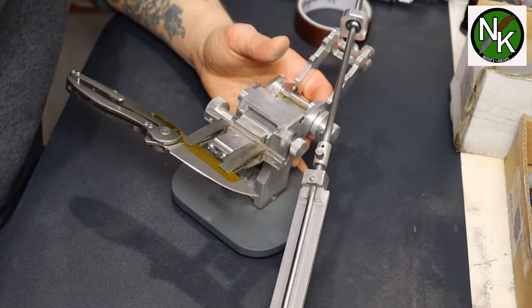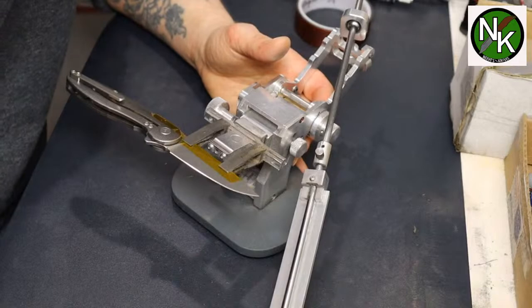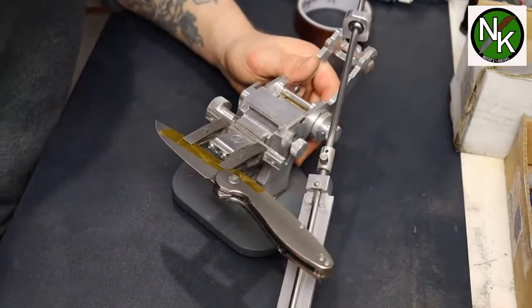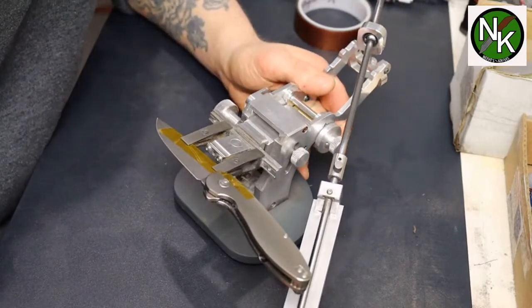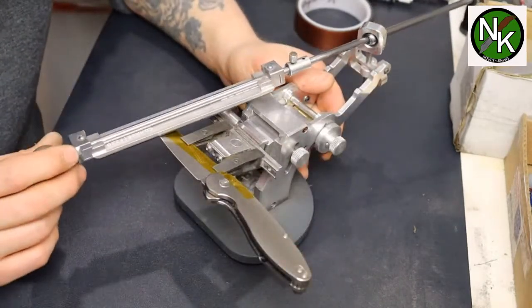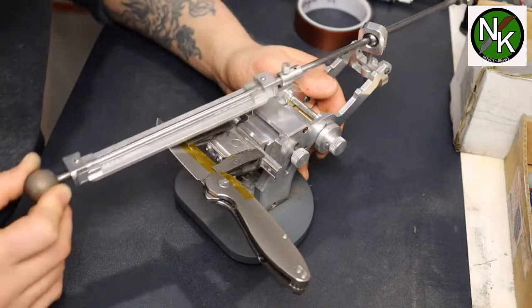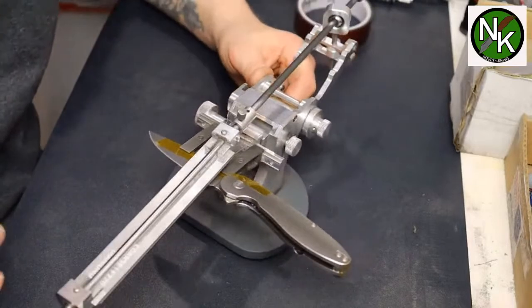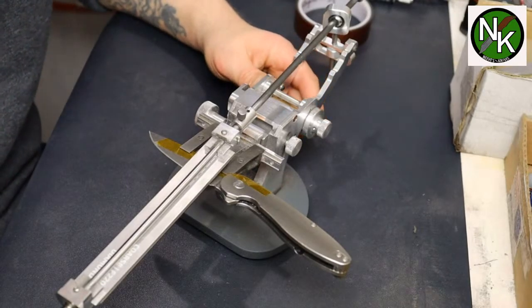However, the problem with it is that you are less likely to hold your angle accurate. You're more likely to do damage, more likely to do weird things. So it's not good. Like tip damage, like not holding your angle accurately, like lowering your angle, just doing things that are not productive and it winds up backfiring for you. That's why light pressure, a little tiny bit, but not much. You could literally just use the stone pressure. But I like to add a little bit more, but I can control it. So if you can't control it, then don't do it. That's basically the way I look at it. If you can control it, do it. But if you can't control it, then don't do it.